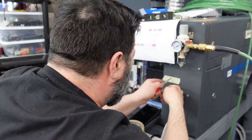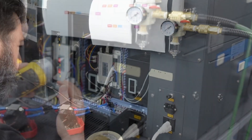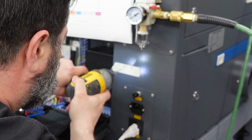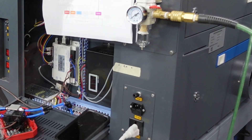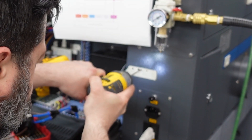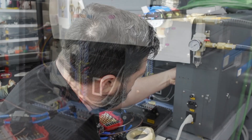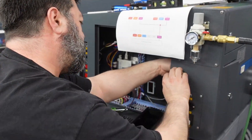I did have a few things that were kind of screwy. I messed with the bolt holes for the solenoids for a while — I had to make the holes bigger so that all the screws would fit in there. Just be careful as you're drilling: make sure there isn't anything behind it. I made sure all the wires and everything were out of the way before drilling.